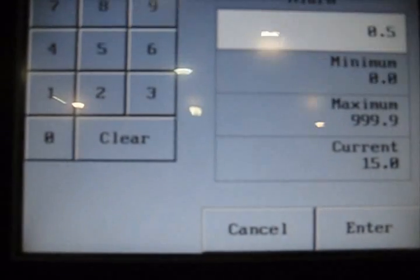The next thing we're going to look at is the timer. The timers give you an alarm time — I don't want it to ring for 15 seconds, that's too long, so I'm going to put in five seconds. Gas stabilization is when the gas comes on before the RF. Atmospheric vent is the amount of time the valve will open to bring the chamber up to atmospheric pressure. The purge vent purges any noxious gases. Vent delay keeps the vent from coming on while the pump is still engaged.